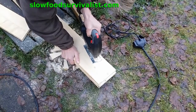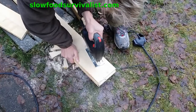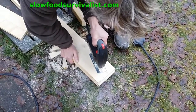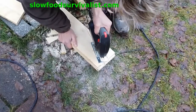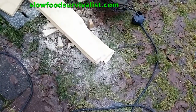And then to the side panels. In order to make two identical pieces, it is advisable to clamp both panels together and cut them at the same time. First, we shape the front end. It is not necessary to do any careful measurements at this point. I use just freehand to draw a nice streamlined curve to guide the cutting.